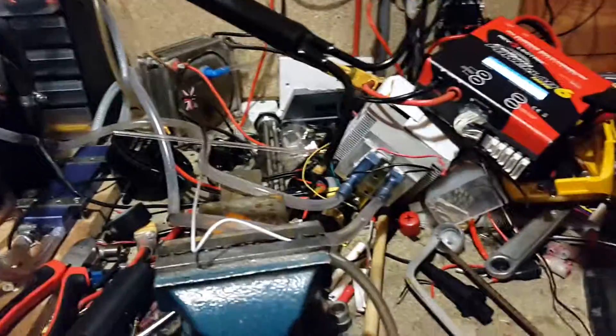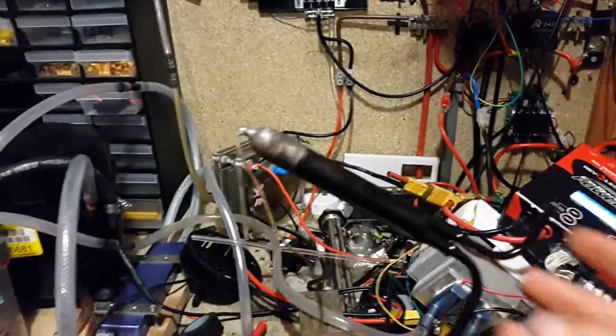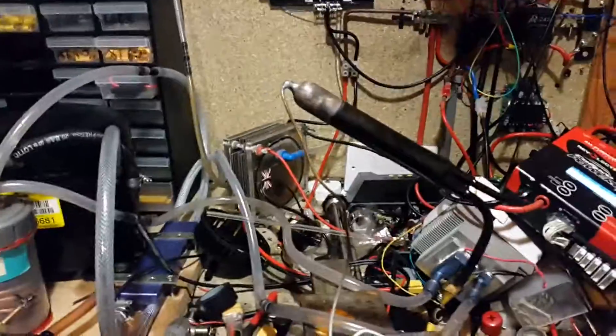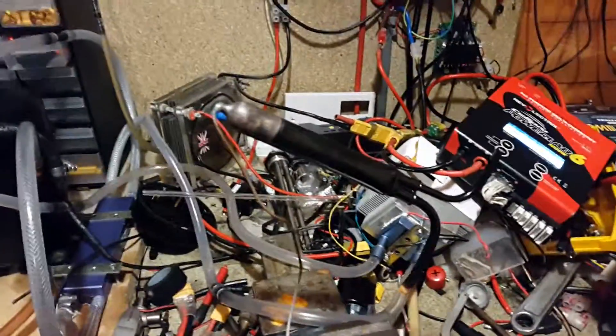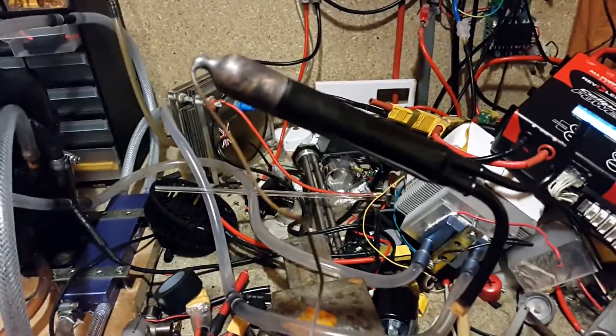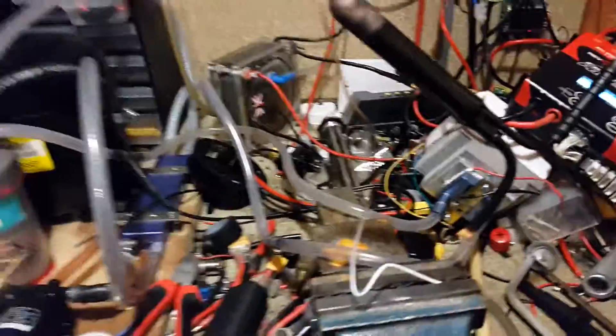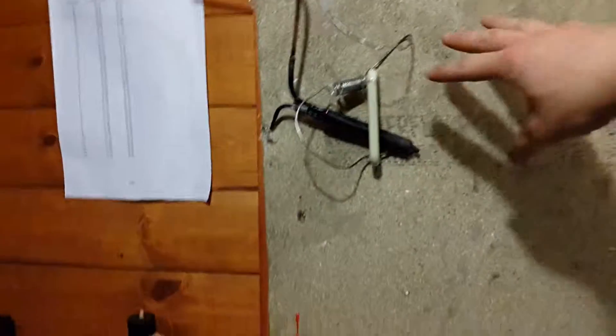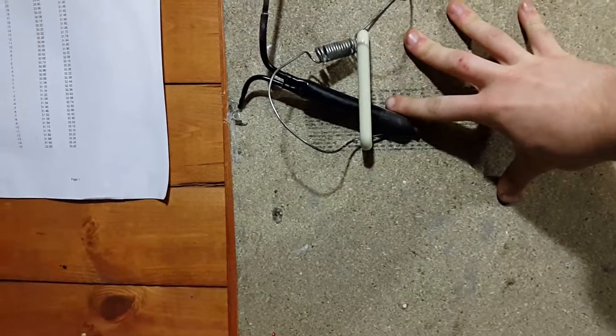The first thing I wanted to explore was reusing these filter dryers. I was thinking that I could heat them up and get all the moisture out. These can be bought fairly cheaply on eBay — about £2 — but the point is to try and reuse them. This one's been done already and I'll just braze an extension tube on it.